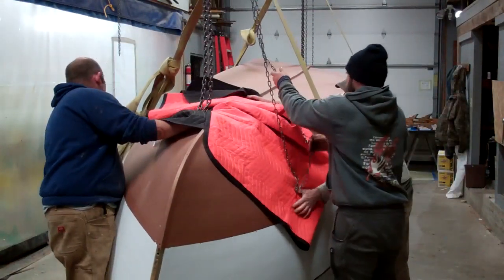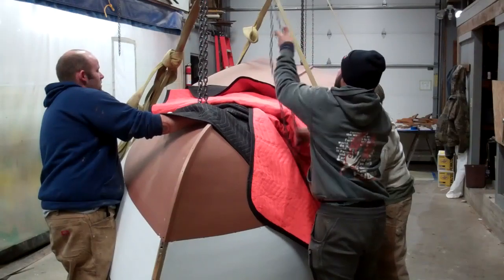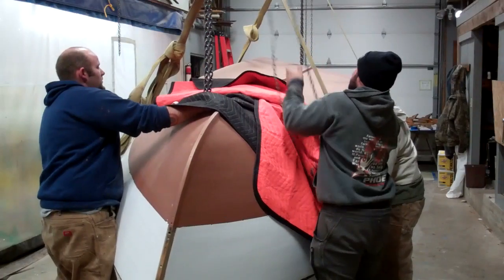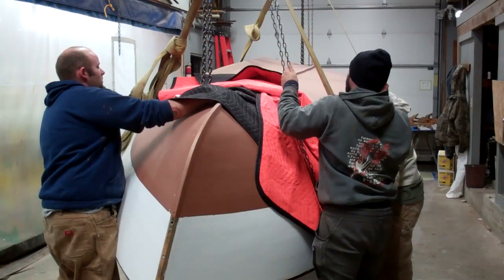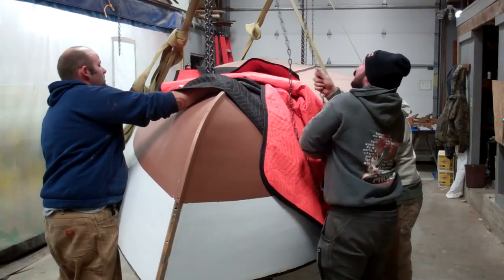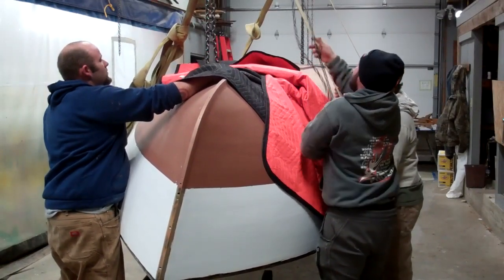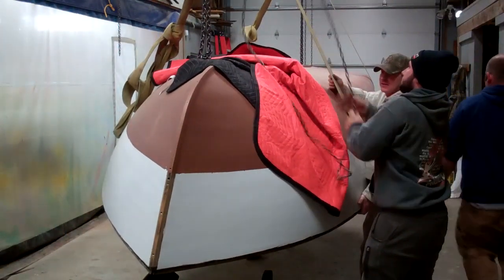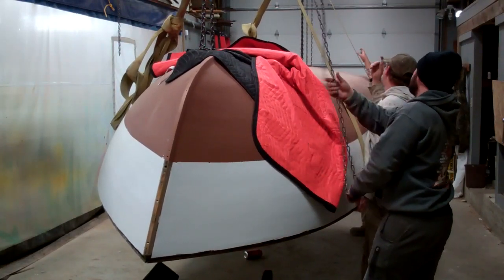2019. Our 1958 Penn Yan Sealiner has reached and blown through an important milestone. Her bottom is finished. We've applied 3 coats of Pettit Hi-Build primer, followed by 3 coats of Sandusky copper bronze anti-fouling bottom paint. And that was after final fairing, sealing with 3 coats of clear penetrating epoxy sealer, and then applying the bottom paint.